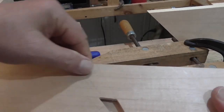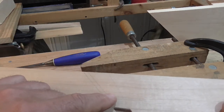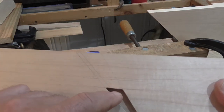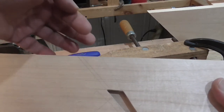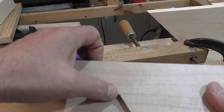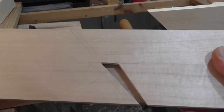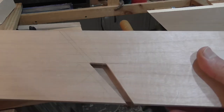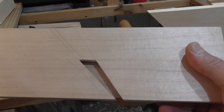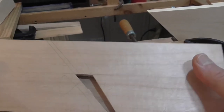And then at that point, this internal pocket is only about 1/2 inch from everything that I'm doing through this opening. So I come in with a drill bit and I connect this area and the pocket. And then I start opening it up with my plane maker's floats, my rasps, the chisel itself, whatever I need to do to open that up. So that's what I did.